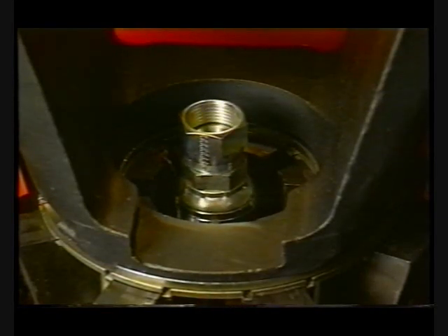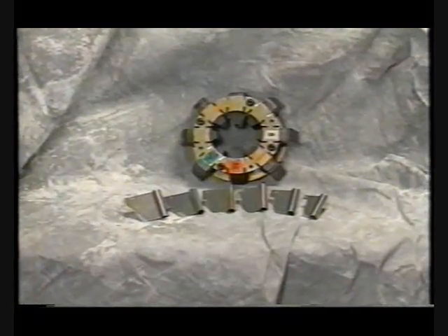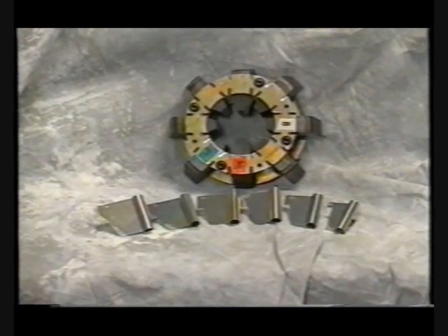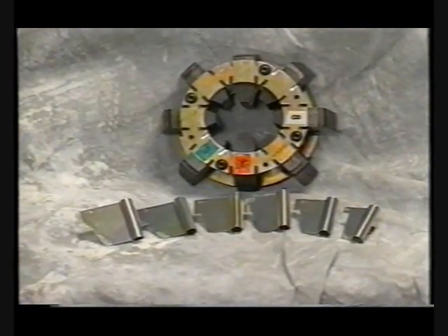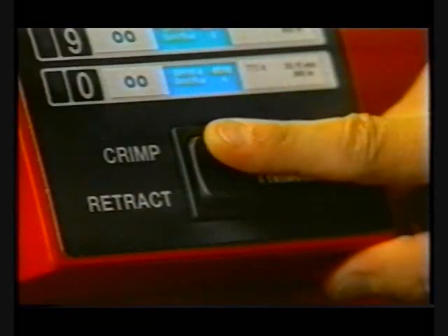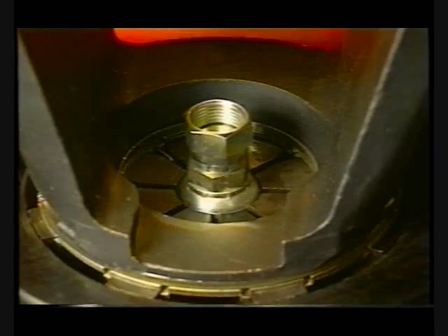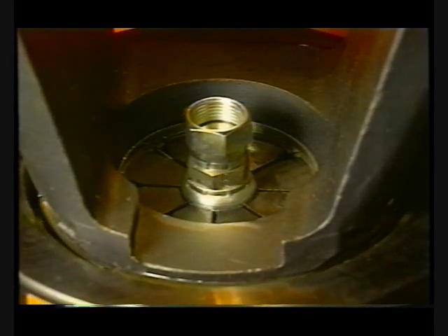Then position the fitting. Align the scribe line with the top of the die. Use of the locators found in the optional FT-1330XL kit makes it especially easy to crimp all sizes of Matchmate Plus hoses. Next, depress and hold down the crimp switch. The crimp ring will continue to rise until the fitting is fully crimped. It will then stop and begin to retract.